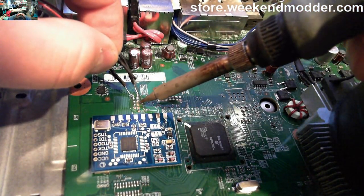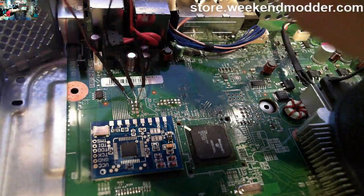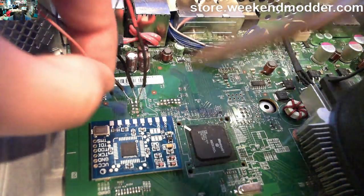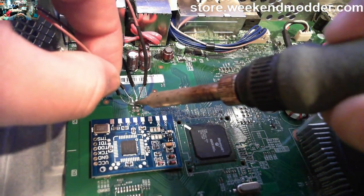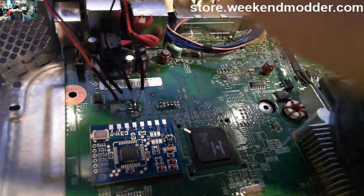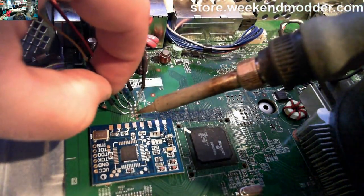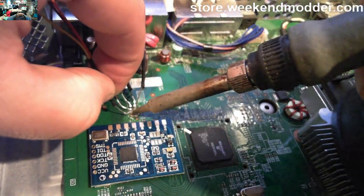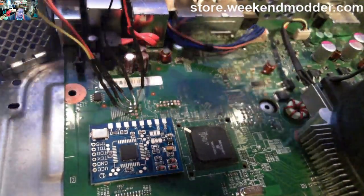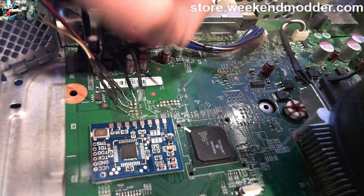Black, brown, red, orange, yellow is what goes on this side. So we've got the red wire in, now the orange one. Then yellow — which is ground again — so if we have to hold the iron on it for a little longer, that's kind of normal.